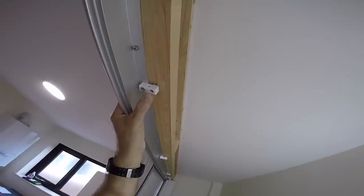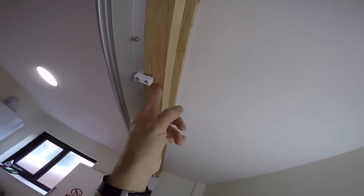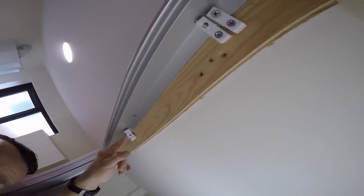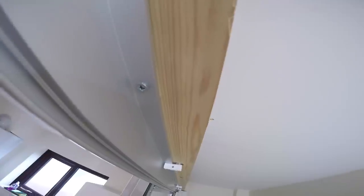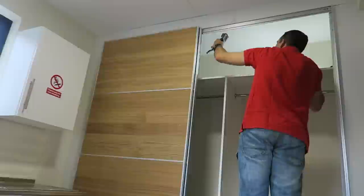So I fixed the top rail. How I fixed it - I used those plastic holders here, or brackets. One part is going to the wood straight to the wood, another part through the rail. And here I got a few of them together where I didn't feel like the rail was holding strong enough. I put a few more on the side, and it's all along the rail. Exactly the same - I put some thick screws on the main frame as well, straight through the frame to the wood. So there is plenty of grip and the frame here wasn't moving at all with the things inside.